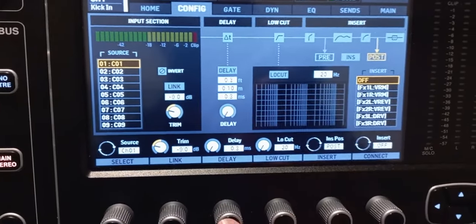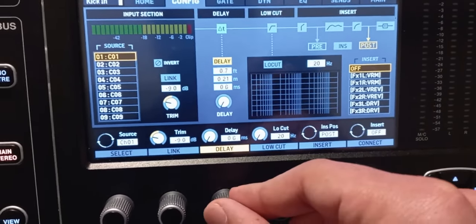If you have these microphones, or let's say the bass guitar, right? You have a DI and you have an amp. You have them together. Do they feel not bassy enough? Do they feel hollow, like there's no bass at all? They are probably not in phase. So just click the polarity button and that sometimes will fix it. Sometimes not. Maybe you will have to do input delay on the channel to align them, measure the delay. But oftentimes, the polarity switch is enough.